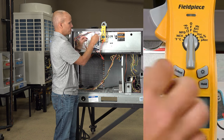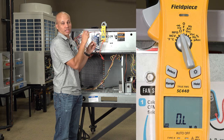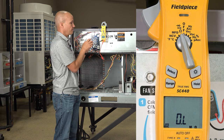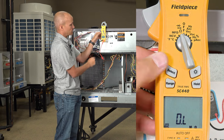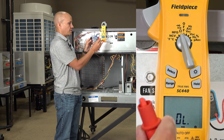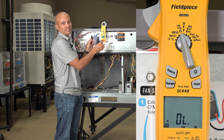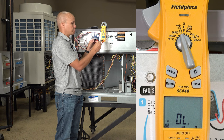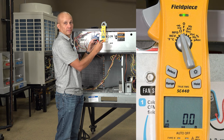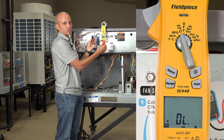On my electrical meter, I'm going to go to the continuity setting. On mine, it shows like a little sound wave. Because it's a multi-choice setting, I have to press select to get it to choose that option on my screen. Now what it's going to do is send a voltage out on the red wire and expect it to come back on the black wire. If it comes back successfully, it'll make a beep. So if it's a continuous loop, it beeps; if it's not a continuous loop, it doesn't beep.